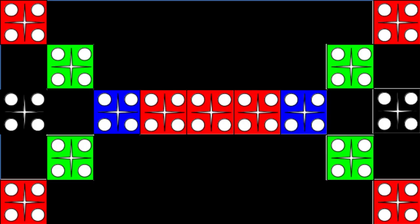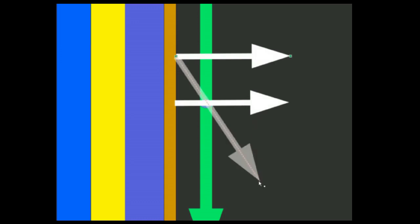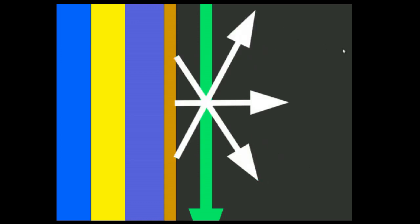I made a simple test pattern for checking the picture quality of my projection. The projection looks pretty sharp in the center but picture detail level goes down towards the edges because bright areas and colors basically bleed out towards the edge. The edge bleeding is a consequence of my light choice. Unlike a projection lamp that produces parallel light, my lamp emits light in a wide angle so that each pixel gets light from different angles.